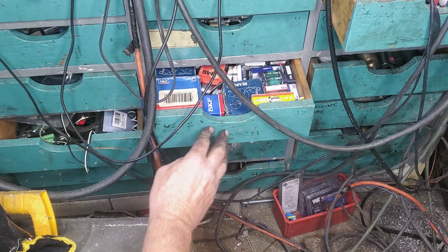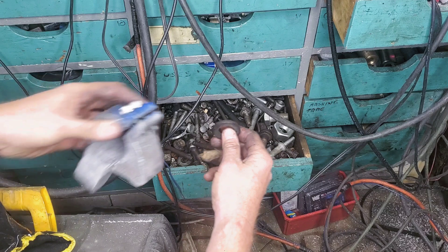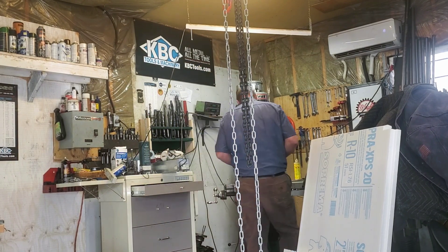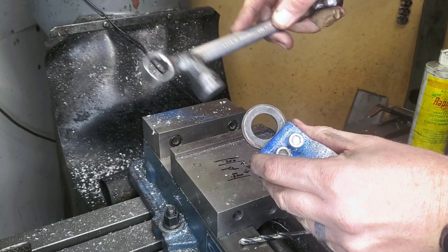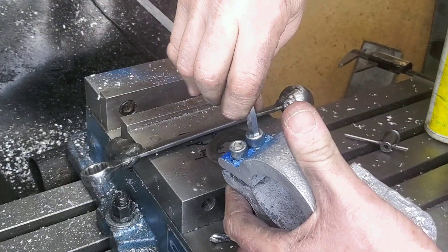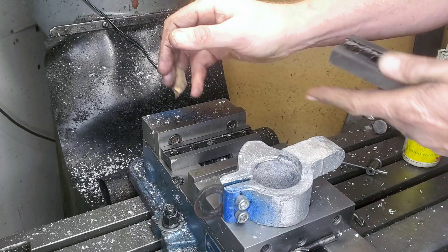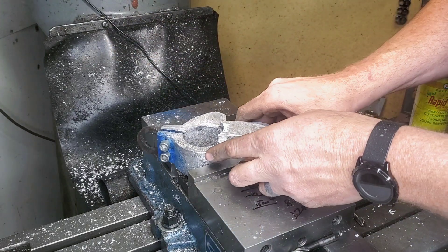Let's go over to that little bolt bin and grab a washer of the right thickness. The reason I'm grabbing this is we're going to move on to the boring operation for that larger hole. I can't exactly be holding a drill key in there, and if I wasn't to put the spacer in here and clamp it down in the milling machine, I'm going to get a weird size when I relieve all the pressure on it, and it might work its way out of the vise.